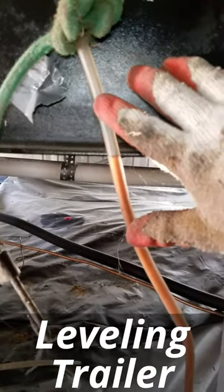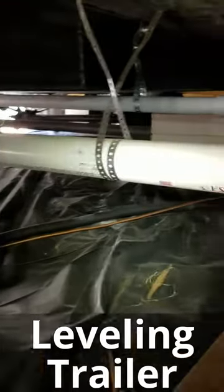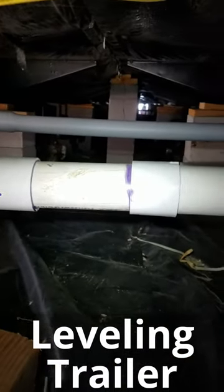We're going through getting everything level with the water leveler, and as we go through leveling everything, we straighten up any leaning block piers as needed and replace any damaged or cracked blocks as needed. We just go through and do the same thing throughout the whole home.